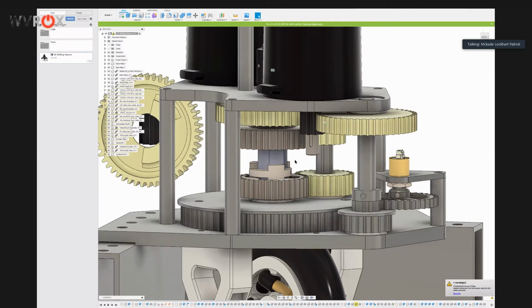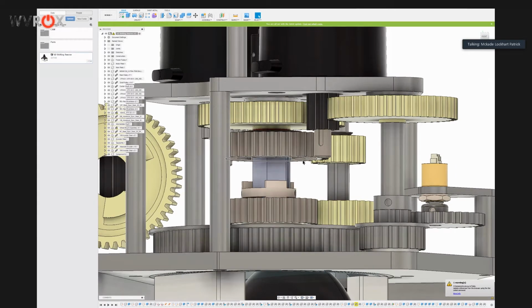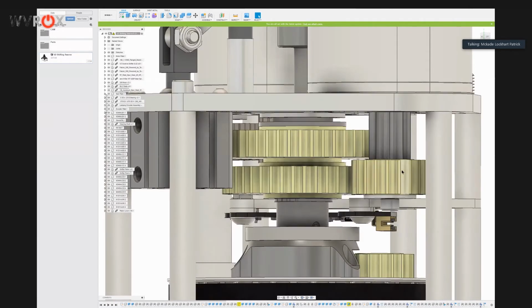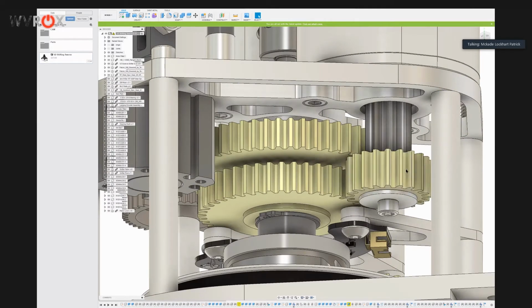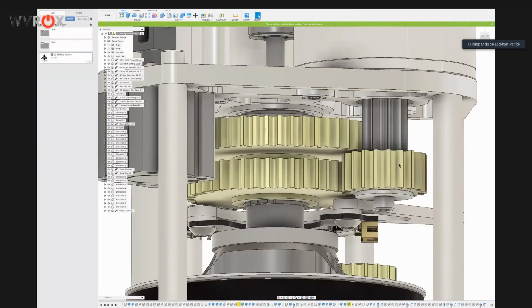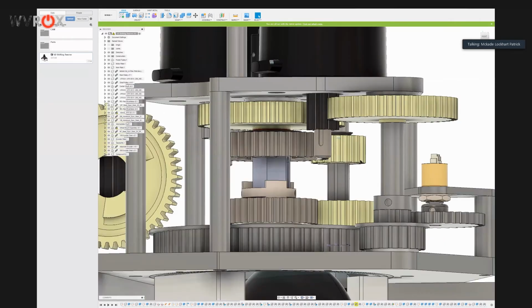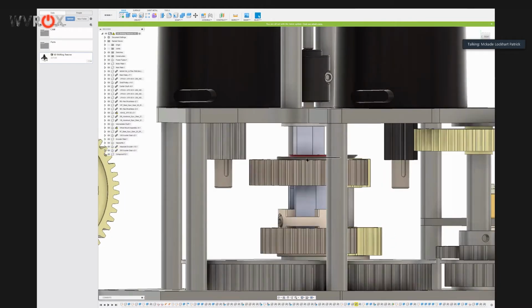Originally we were trying to use a dog shifter, and this comes down to how the gear stacks are aligned. In the version that we're currently making, the Falcon has two pinions stacked on top of each other. To get the spread that we wanted, this is a hex adapter, and then we put a 20-tooth gear on it, so we can get over a 2-time spread while still keeping everything on one Falcon shaft. Before we figured out that we could do that, we were still trying to use Neos, and we had to machine a hex into the top of a dog shifter.